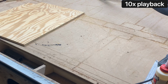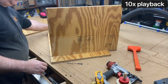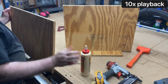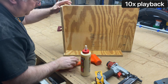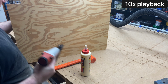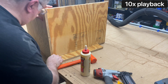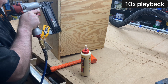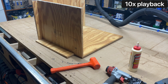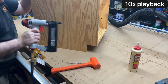So there we are. It seems like a lot of people default to using 3/4 inch plywood for making cabinets. And I guess perhaps there might be some reasons for that, but it seemed like really overkill, and so I made this with basically, I think, 5/8 inch thick plywood, and it worked great. One of the reasons I think people have in their mind for using thicker plywood is to keep it from being split when you're putting screws in it, but you can pre-drill. And in my case, I felt even that screws were overkill.